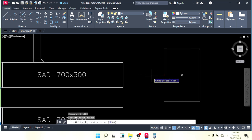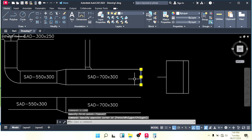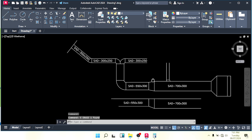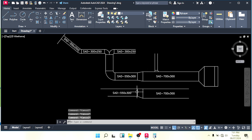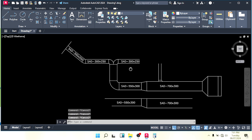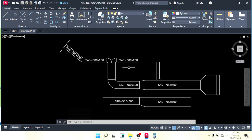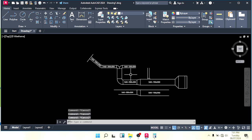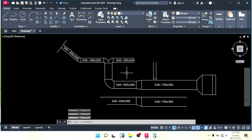The mouth connection minimum length should be 40 cm. Bring the line and connect it to the duct. These are the basics of ducts — you must know these before drawing a ducting layout. There is another video in my channel where I teach you how to calculate duct size, so watch that video carefully. If you have any confusion or doubt, you can contact me or leave a comment.